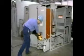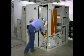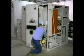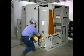Is this the way you rack your circuit breakers into and out of their cubicles? Racking the breakers in or out of cells manually can expose personnel to one of the 5 to 10 arc flash explosions that occur in electrical equipment every day. During manual racking, interlocks can fail, causing the breaker to close, and this can cause serious injury or even death to the operator standing in front of the energized unit.